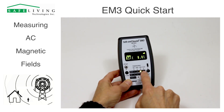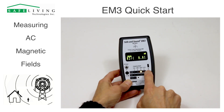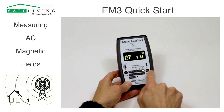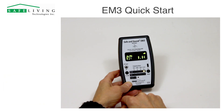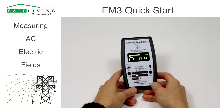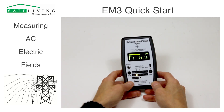If we want to measure just the 16.7 Hz signals that might be present in this area, push and hold the mode. Each time you push the mode button, it steps through the different measurement modes. The next time we push this, we're going to show AC electric in the full frequency range — in this case, this meter can measure from 50 Hz all the way up to 400 kHz.